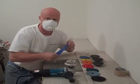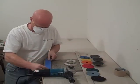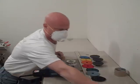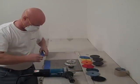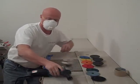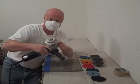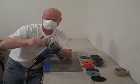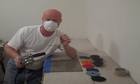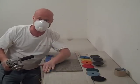I take a piece of tape to protect the edge of the stone, because this tool itself is made out of metal. If the metal hits the stone while it's up to speed, it could leave a little mark on it, which is hard to get out. But let me do this for you real quick.